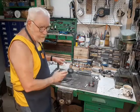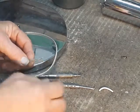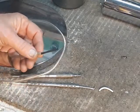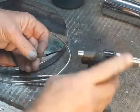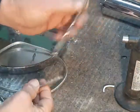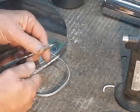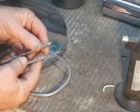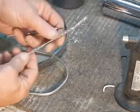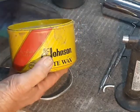Before I start pushing the wire through here, there's a couple of small pieces of preparation that have to be done first. I'm using a cord set, so it comes with the ends of the wires already soldered — or tinned as I call it. To keep them from getting separated and possibly snagging, I put a small piece of shrink wrap over it, and that will make it a little easier to push it up through the pipe. Next, I check out my dental picks, which are going to be very important for pulling the wire through. This one has a sharp tip, so I don't use it for putting it back together — it doesn't really matter if you tear up the wire taking it out, but you don't want to tear up the wire putting it in. This other one, with two different shaped hooks that I have bent on them, is going to be useful for pulling the wire up through the top. And the last piece to have handy is some paste wax, because you're going to need some lubrication on the wire to get it around all these corners.